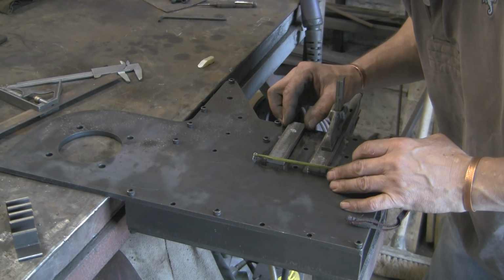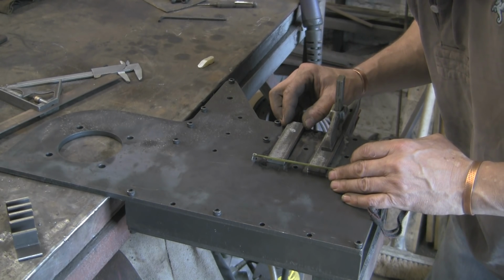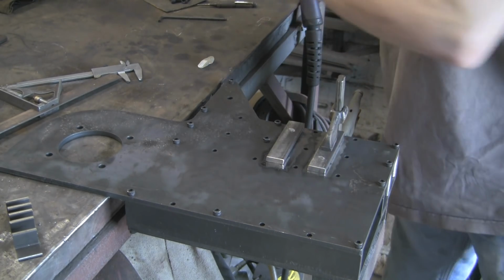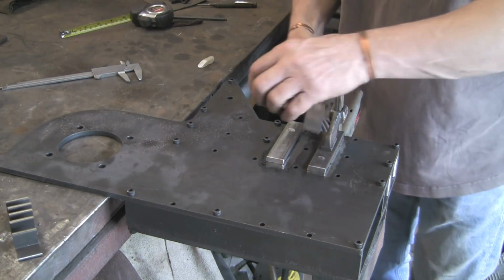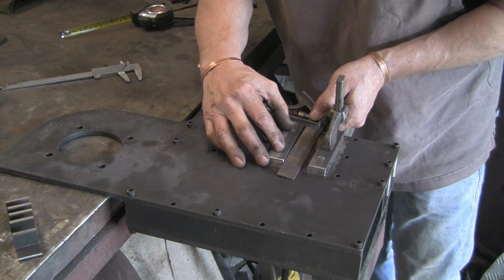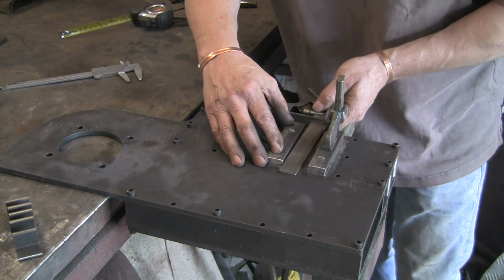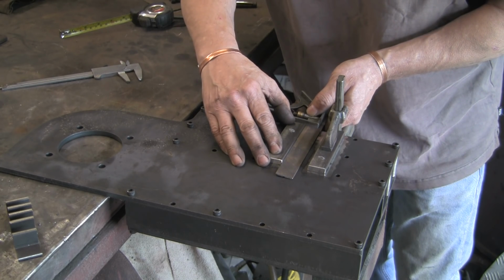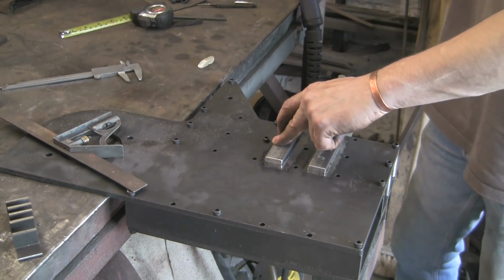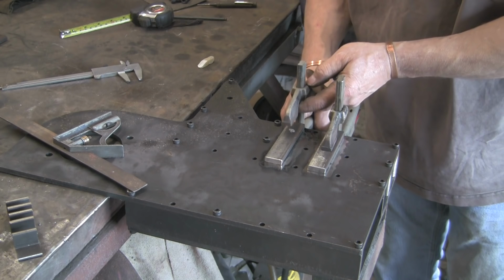You're sort of burning straight into fresh, clean metal. I'm beginning to learn this with my TIG welder. I don't know if I've told anybody yet, or if I've done it on YouTube, but I bought myself a TIG welder, and I've been playing about with it. I haven't done an awful lot with it. Done quite a bit of aluminium work with it, and clean, clean, clean is the only way to get decent welds. And it's sort of rubbing off in my MIG welding. You know, MIG will go through all sorts of rubbish, but if it's clean, it really does come up much nicer.